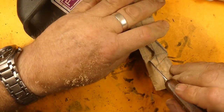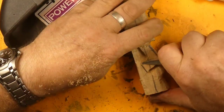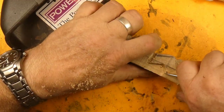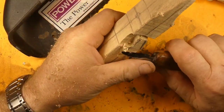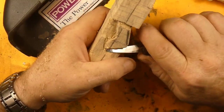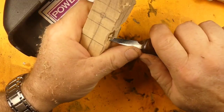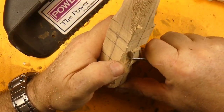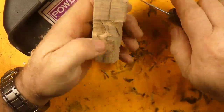Okay. And I got the OCC inch and 3/8 knife. Doing a little cleanup. You can see we're cutting the hand down to put it in the pocket. Like I was saying earlier, the Dremel burrs, or the burrs that we use, the carbide burrs. I guess I could have used a diamond burr, a real pointy diamond burr to get in there, but the knife is just so much quicker to come in and undercut the hands to put them in the pockets.